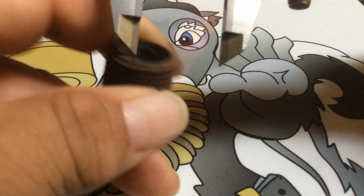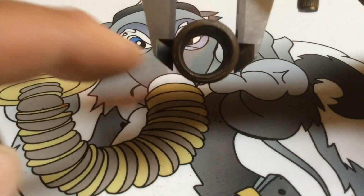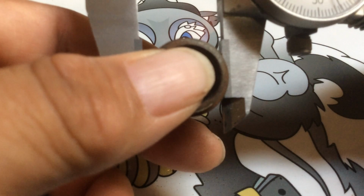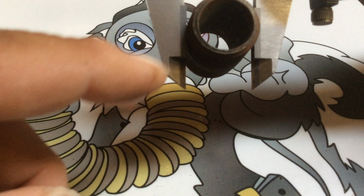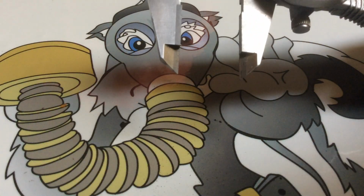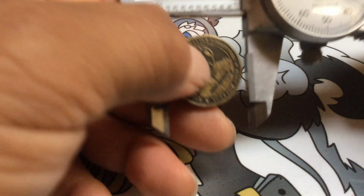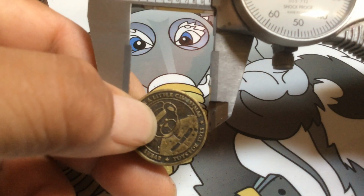So that's what you want to do. Don't get in the habit. Everybody gets in a bad habit. Just this is the way I check it, I use the tips. Yeah, you gotta use the whole length of the jaw right there. You got the surface from here to here. You don't have to just stay right here. You want to use the whole surface every time you do something, so you get in the habit of making it wear evenly. See? Hold it up there and you get a reading. Hold it down here. So they wear out evenly. See?